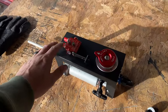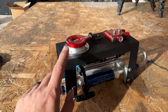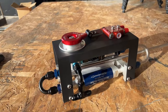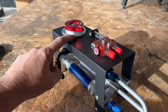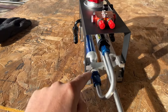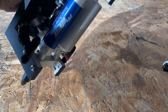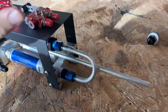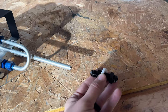I really am excited with how this turned out — it is beautiful. I ended up having to paint this. There were several options I was going to go with: I thought I could vinyl wrap it, maybe do some powder coating, but in the end I just used a little bit of primer and some flat black enamel paint. It looks great and should be decently durable for what we're using it for. We need to install this inside of the airplane now. I got the hardware — it's going to go through here and through the floor, and we'll bolt that up through the carbon fiber flooring to make sure we don't have any corrosion problems. I went ahead and put rubber feet on the bottom of this, so we'll have to poke some holes through that to make that work. And then that's going to go to this fitting, which is a firewall fitting. If you can imagine, that's going to be in the firewall.